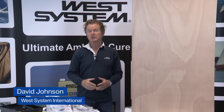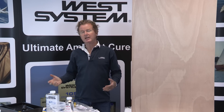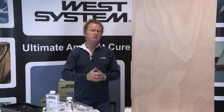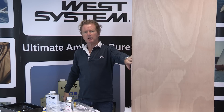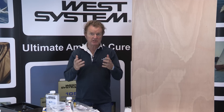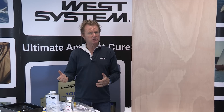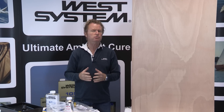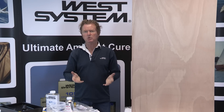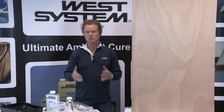This is a video about coating — some of the principles and techniques involved. Why would you want to coat a plywood component in epoxy? Coating a wooden component in epoxy does several things: it enhances the stiffness of that part, inhibits moisture and inhibits oxygen, two of the main components that cause rot. By inhibiting moisture you really limit movement and stabilize the wood structure.